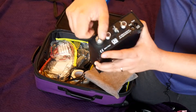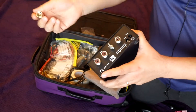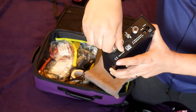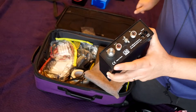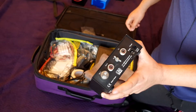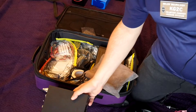For the antenna connection I've adapted it to my BNC connector by using an adapter, because the connector on the tuner is SO-239 and I have my PL-259 to BNC adapter here. And for the radio, right now I have just the regular SO-239. Sometimes I put an adapter there as well, sometimes not — depends.